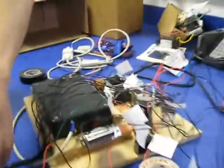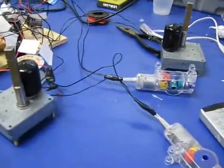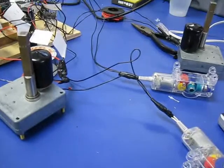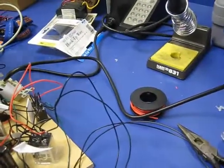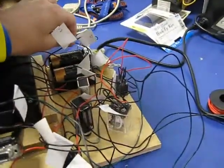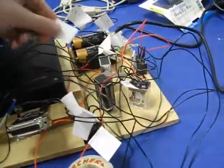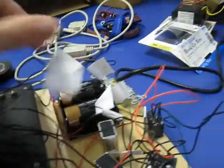And then we have four inputs. The light switch there is for debugging so we can get the torque motors lined up correctly. And then we've got 17 and 18 — 17 should be right here, that's 17. 17 and 18 — we're going to wire these up to a momentary switch, and that's when we'll start the programming that's on the control chip.